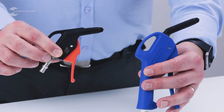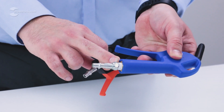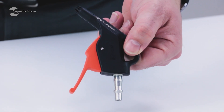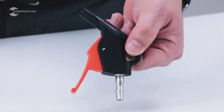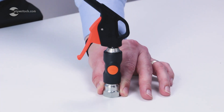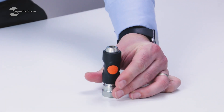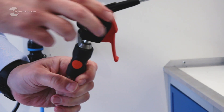Connecting them to your system is easy. The traditional blowguns require a corresponding adapter to be screwed in, while the S1 blowguns have an integrated plug. All you need to do is push them into the safety couplings until they click, and they're now sealed and ready to use. Disconnecting them is just as easy — just press the safety coupling's coloured button and the blowgun will safely click out.